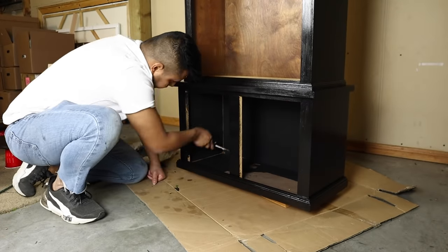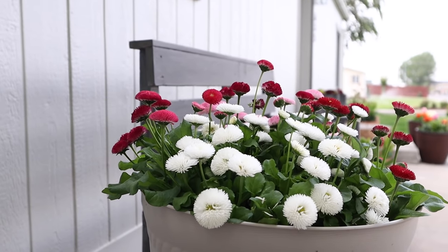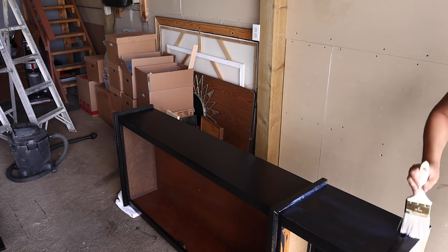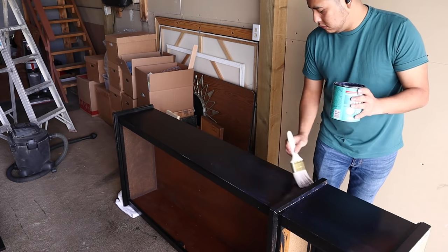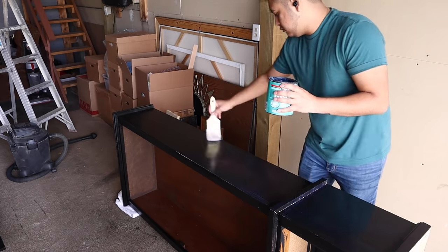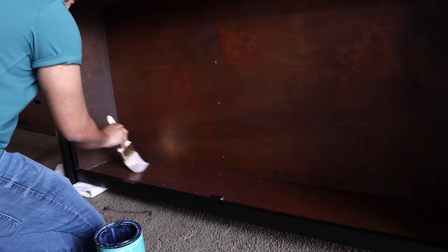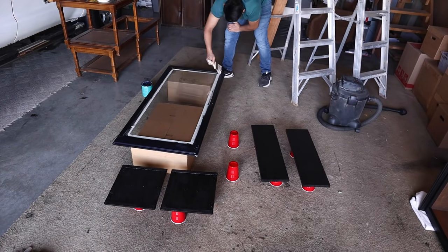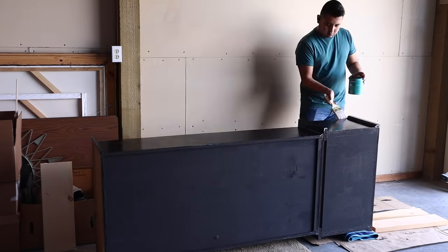I almost forgot, but I painted the interior of that bottom cabinet black, mostly because there was a hodgepodge of different kinds of woods. It is the next day and it's time to apply a protective finish. I'm going to be using polycrylic rather than polyurethane because it dries faster. I always like to use the one in the matte sheen — it feels a little bit more professional, and especially with darker furniture, I don't really want any glossiness. I apply it in horizontal fashion to avoid drip marks, and I applied two coats in the end.